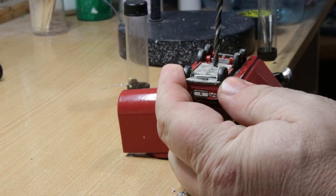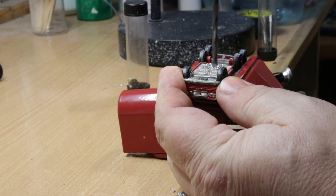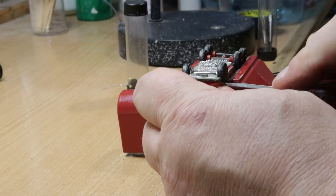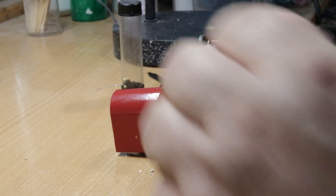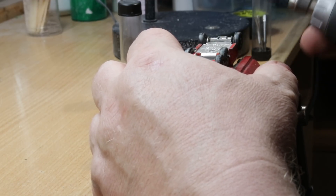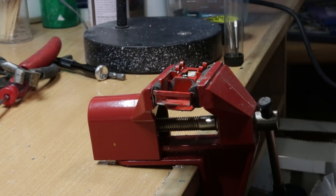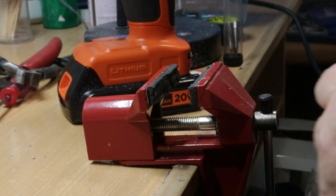I would like to say this was a simple restoration, but really it had the benefit of going fairly smoothly. As is typical, I'm drilling out the rivets — or the stakes rather — and I'm going to remove the chrome plate bottom. It didn't take long to figure out that in order to get the bottom off, I first had to remove some of the wheels, because the axles ran right over the bottom of the chassis. This was followed by the drilling of the post, the tapping of the hole, and the insertion of a button screw.